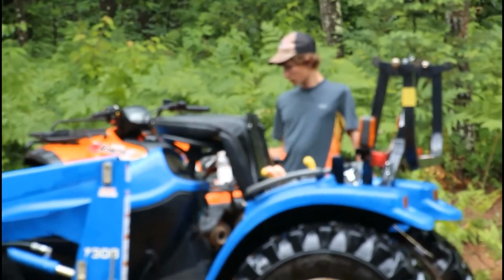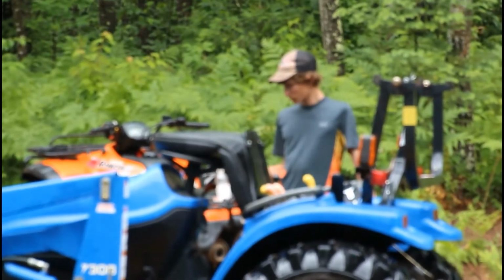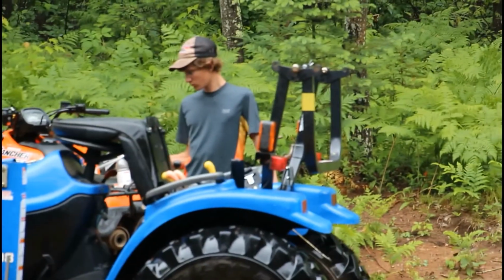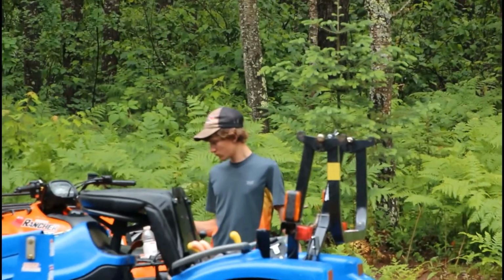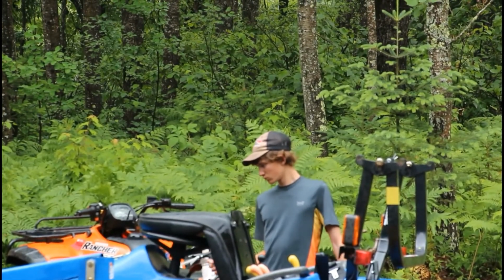Use the 2x4 in line with these to set our taper. Because we do have a 2-inch per 24-foot pitch on this floor to run the water out the doors. It's lower on this, the door side, than the back side of the garage. Oh, that's smart.